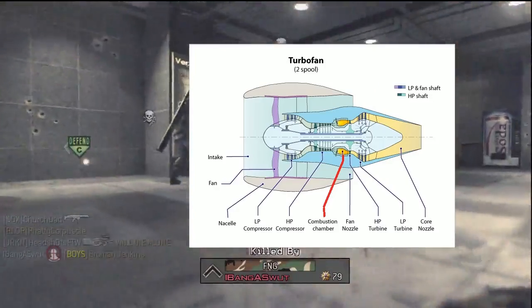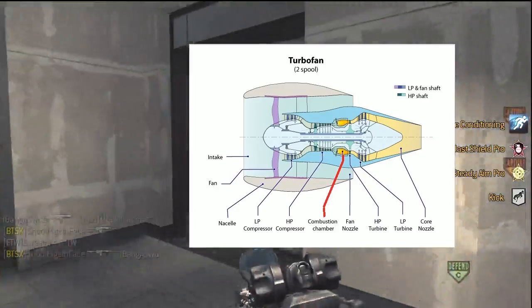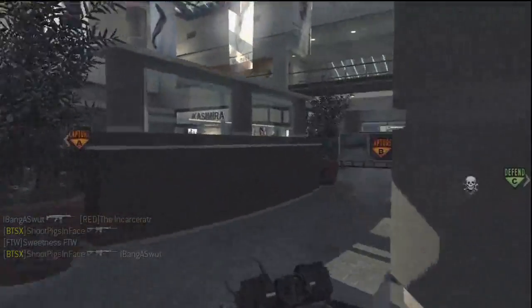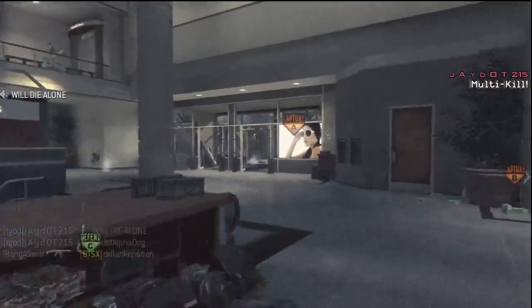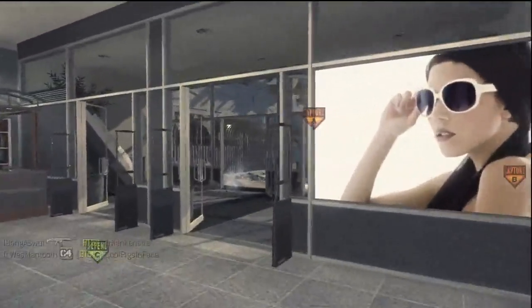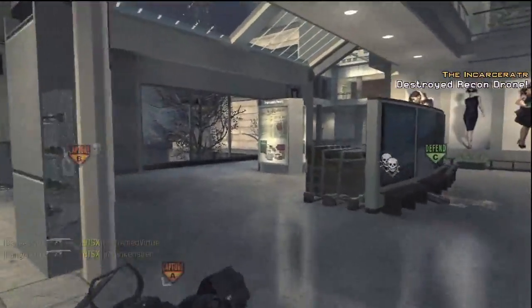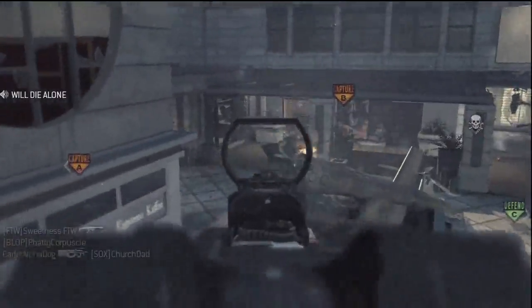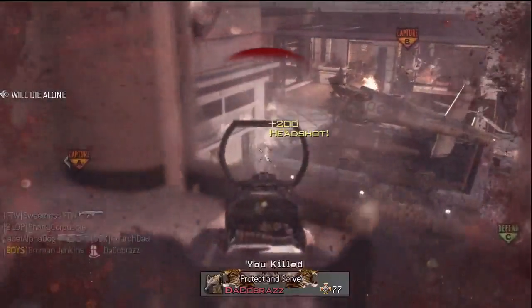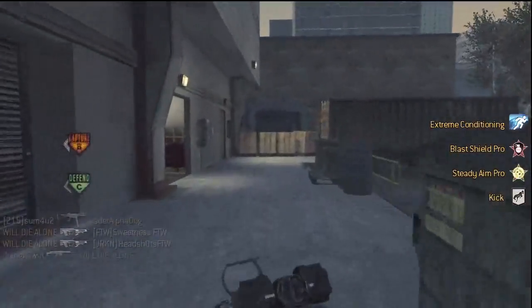Now, the diffuser case is where the fuel mixture is applied to the air and then ignited. It's ignited with these big, too big, I should say, basically spark plugs that come in from the engine, called igniters, because they're simple like that. And the igniters basically set the air on fire through electrical current and push it out further. I should make note of this.